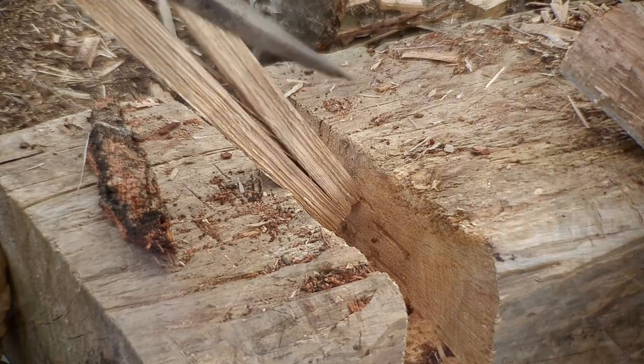The riving brake can't overcome defects in the wood, but it allows you to wiggle past them if possible. This is simultaneously one of the benefits of riven wood and one of its biggest defects — if there are any defects in the log, you'll end up with less usable timber than if you sawed it. But the advantage is that you'll see the grain follow the hump of the split and can either reject that piece or build the grain flow into the project for an exceptionally strong piece of timber — something you can't do with sawn timber. Like many traditional crafts, it takes time and skill, and there are reasons why we use machines a lot these days.